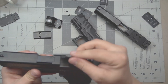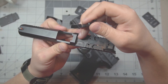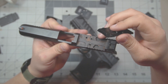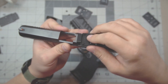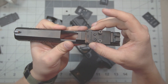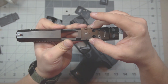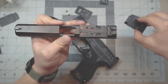The play in the stock Glock system is about doubled compared to the CNH system, but all the same, the shear force is transferred into the face of it because it fits significantly tighter. The side-to-side shear is transferred through the bar, and the forward-and-back through the nub. Other manufacturers have improved upon this system. The CZ plate system actually has a crossbar to handle lateral movement with a large central lug, and longitudinal movement with spurs off the side, creating a very, very solid, almost no-play system.